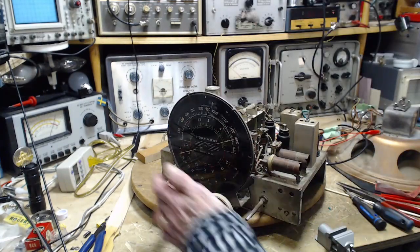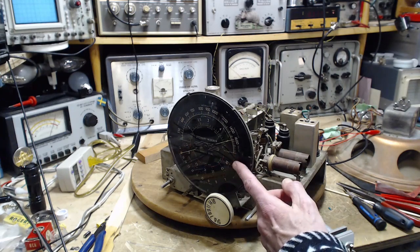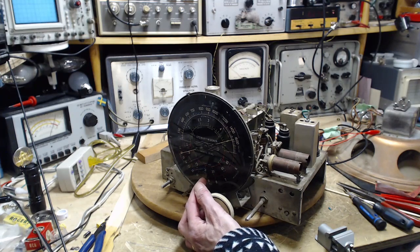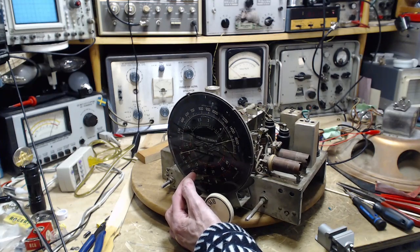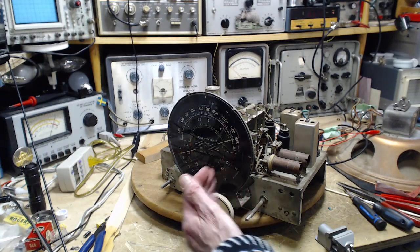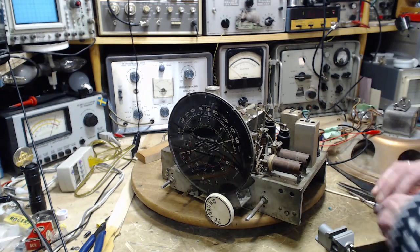Now this band is going to be fun for the owner because you can pick up shortwave around the 6 late in the evening, right? And then you can pick up a little above the 7. Above the 9, you pick up shortwave during the day, sometimes strong in the later afternoon. A little higher than 11, you can pick stuff up. 13, a little higher than that, you can pick up a European band. 15 megahertz and above, you pick up more shortwave. So all across here is interesting shortwave to pick up if I can make the radio work well. But it seems to be working well right now, actually. Let's see if we can get 16 instead of 18.